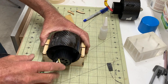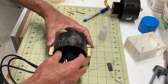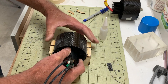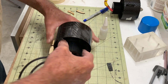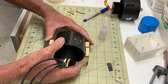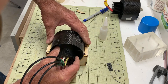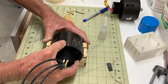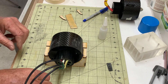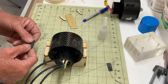What we're going to do is assemble this thing. First I want to look at my wiring — my wiring comes up through the outlet ducts, so I want that to be vertical. I've pre-sanded the sides where the tabs are going to go and cleaned them up with isopropanol to make sure any old epoxy is gone — I need really good adhesion. I've also made some vertical tabs which are going to go on the sides to reinforce these, and I've rough-sanded the edges and tops where the tabs are going to go.